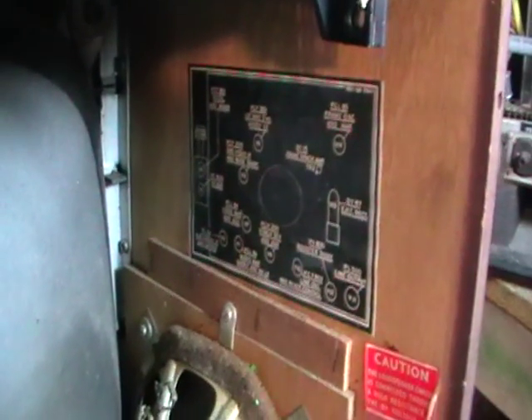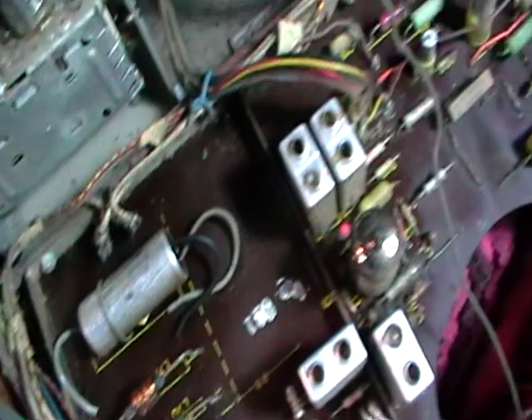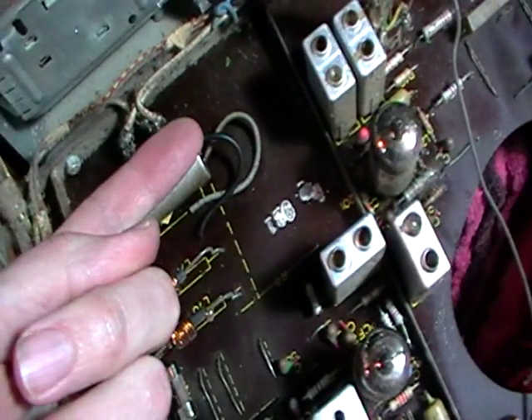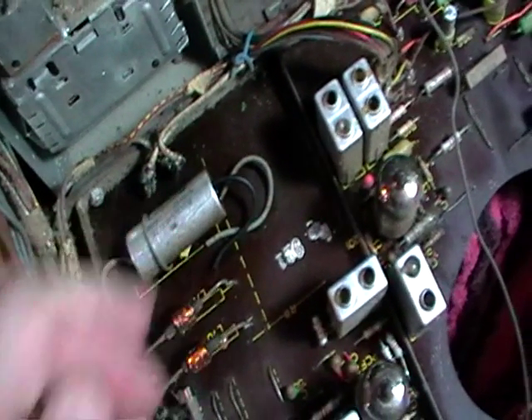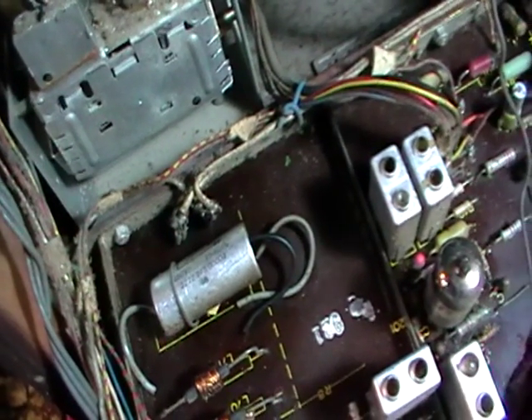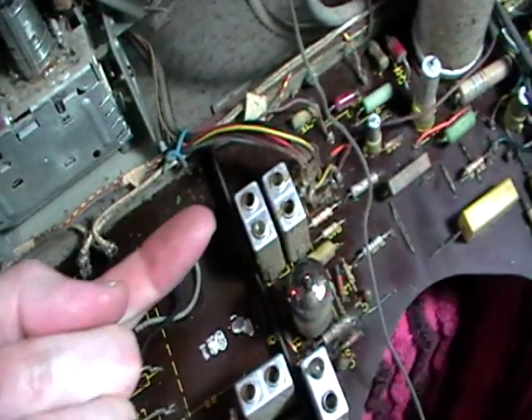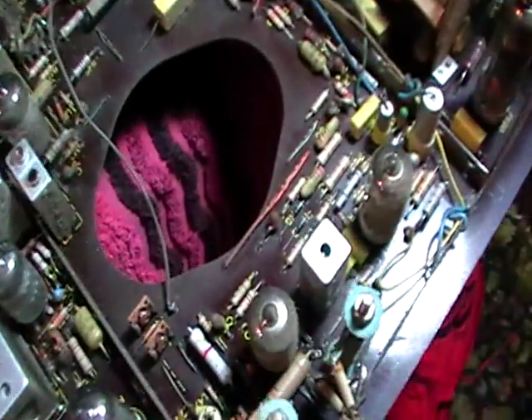There's a valve location chart up there as well, just for everyone's interest. The other thing about these AC mains filter caps: they have a habit of leaking and blowing their guts. I remember one that literally exploded inside the set - the back was on at the time - it just blew out the side, and there was a big mess of foil and tar splattered across the board. Boy, did it stink the workshop out - absolutely reeked.